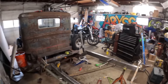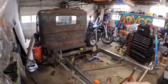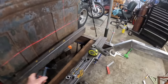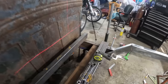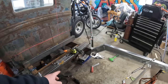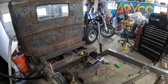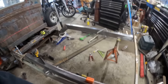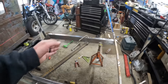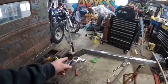And what was happening was that frame rail was sticking way far out. And I used a laser distance finder right here, shot multiple locations inside the frame rail there to come up with the same measurement throughout. So I knew that having this in plane, I can then work off that measurement and come up with that same measurement in multiple spots throughout.